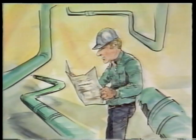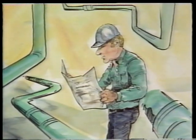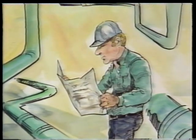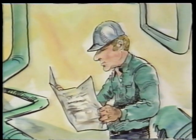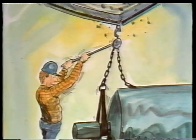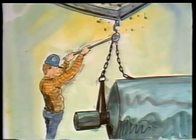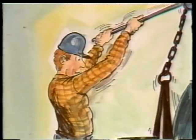Here's the most important point of all: before you start your work, read the specs. The specifications for the bearing will list clearances, operating temperatures, oil specs, and replacement part numbers — all in the bearing specifications or in your plant's maintenance records. You might also find useful information like shaft weight, which can come in handy when you have to hoist the shaft for maintenance. Read through section one of your text and review the information we've covered so far.